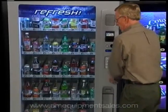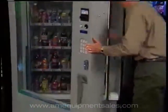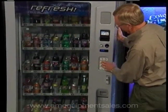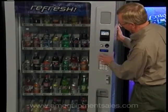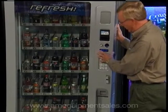Some other things you might want to do in programming: hit your mode button and bring up diagnostics, then button two to scroll down to test mode if you want to test the machine. Hit button four — it says 'vending.' Hit button four again and it will say 'Please close the door.' It will allow you to make up to five test vends that do not count on your meter reading.